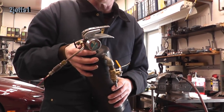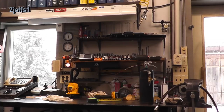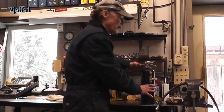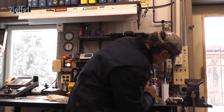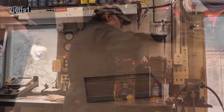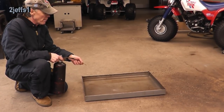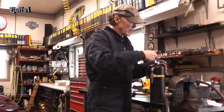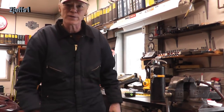The other thing it's good for is if you've got a bunch of brush you want to light up — take out your leaf pile — you can have an inferno in seconds. Let's show you how this thing works. You can fill it: spin the top off, put your funnel on there with your favorite solvent — lacquer thinner, whatever you'd like. Put a little air charge in here and you're ready to rock. Grab your nozzle and you can adjust it wherever you want, adjust the volume, let it rip. Once it's empty, all you've got to do is dump the air charge, spin the top off, get your funnel, refill it, pull the top back on, charge it again, and you're rocking. Too simple. Save you some money.